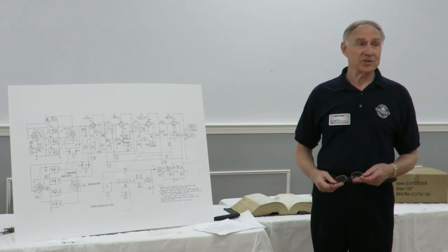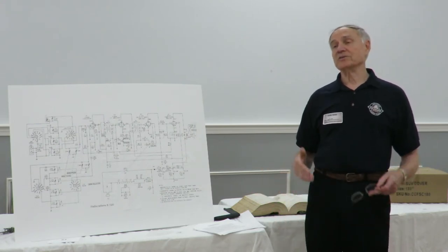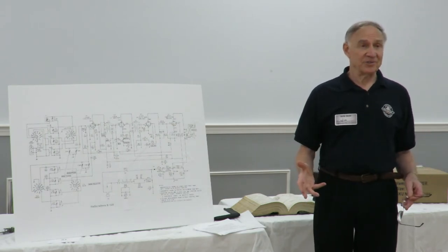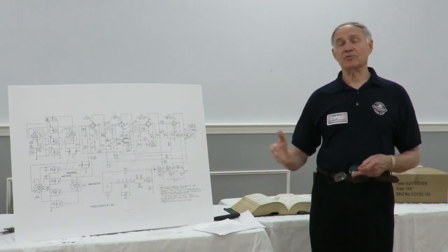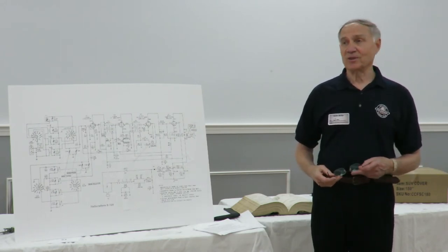The tubes aren't getting any cheaper. It's no fun doing the IF transformers. If you can find a replacement IF transformer, you've got the capacitors and all of that. It's just almost an endless deal. The good thing about the 5-tube radios is there's not a bunch of stuff that can go wrong. As these radios get bigger, you'll end up putting 18 to 20 capacitors into it and a handful of resistors, and you've got the tubes. And after a while, the cost of repair of these things just gets absolutely astronomical.